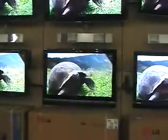We're going to go back to 1/10,000th of a second, and you can see the flickering, which is the oscillation of frequencies between 1/10,000th and whatever frequency that's updating at. And here we see a display which is significantly dimmer at 1/10,000th of a second compared to 1/60th of a second. And what that's telling us is that this thing is strobing a bit, so let's zoom in and find out what model this is out of curiosity.